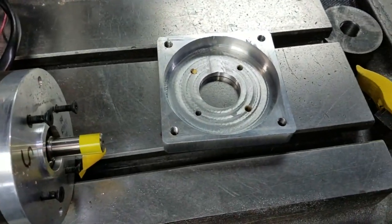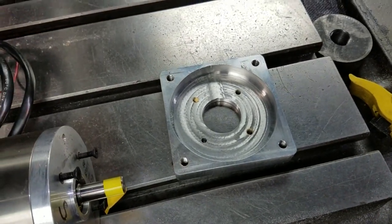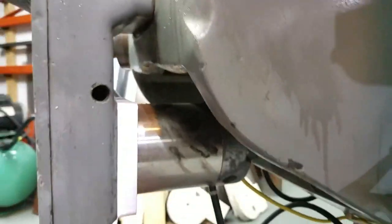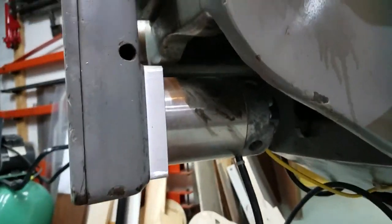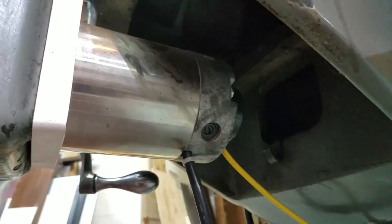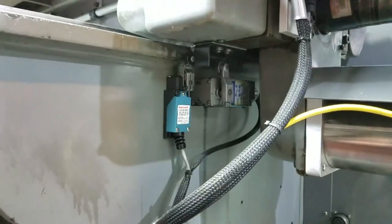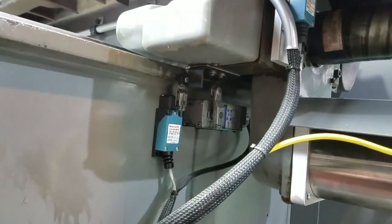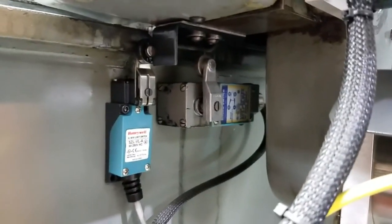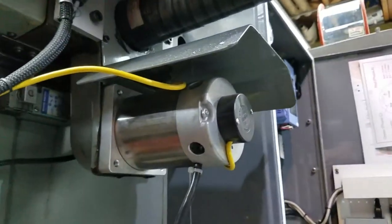This is one of the early adapter plates that I used for the Z-axis. I think I didn't use that plate because I ended up having a dimension wrong on it. You can see the Y-axis servo fits nicely underneath the machine. There's a headspace limitation as you would bump into the knee with a super long servo, so these short servos were a good choice. I added some modern home switches here. You can see the old Bridgeport big micro switch in back, which is actually just the over-travel switch, and the new Honeywell switch is a home switch. Here's the X-axis servo.